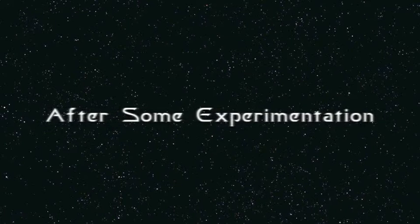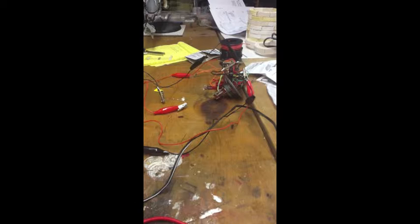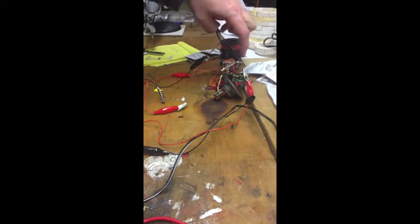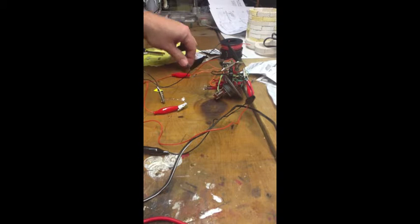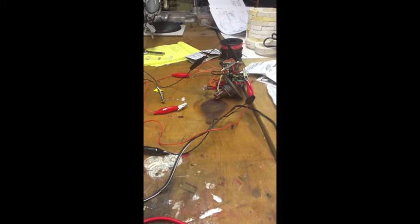I had to make some modifications to how I was originally going to approach making the changes to this existing circuitry. I'm pretty much a novice when it comes to this at this point, and there are some components on this board over here that are interfering with me just putting a LED on the end of these leads that these incandescent lights are on. There must be a transistor or a resistor here that's just not matching up, and I'm adding a second resistor here, and it's kind of causing some heartburn there. I'm actually not getting those LEDs to light.